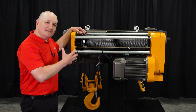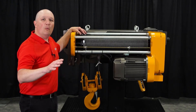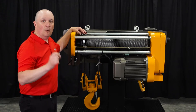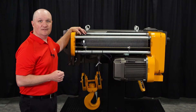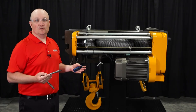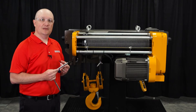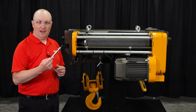Now, let's say that we've inspected this and determined that this Rope Guide needs to be replaced. Always cut power to your equipment. This hoist should not be energized when you're working on your Rope Guide. Your safety is always first. Also, wear eye protection and, if necessary, wear gloves. One of the nice features about our Rope Guide is that no special tools are needed to disassemble and reassemble. You can simply use a 5mm Allen wrench — a regular Allen wrench or a ratchet style.